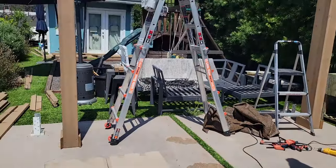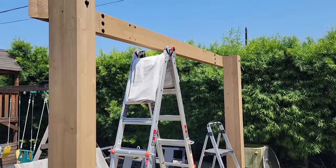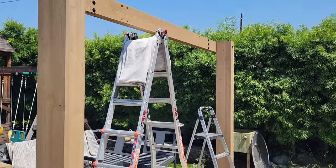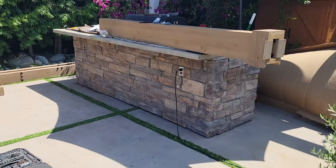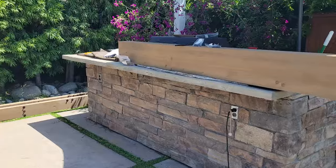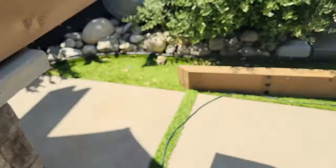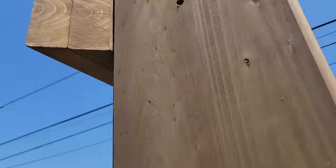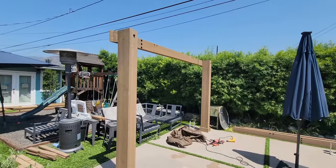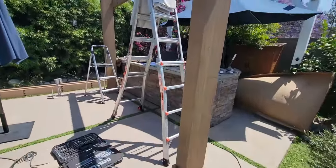One frame connection down — it's fairly stable on its own so I'm comfortable removing the ladder. Two more to go. It's just one bolt, one lock nut, and two washers per connection: one washer for the inside, one for the outside. Now I've got both short ends down and moving on to step five: the gussets.